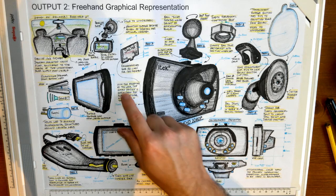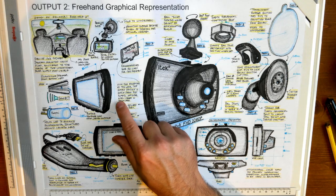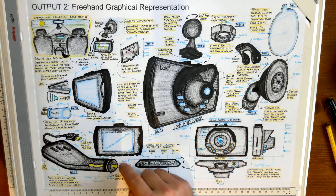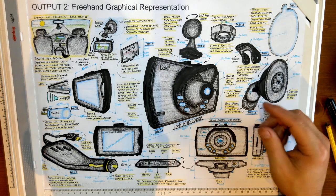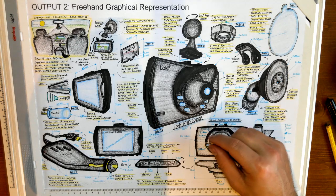I've described materials and so on. With the exception of the lens, the entire product is made from PET plastic material, 0.75 to 1.25mm in thickness. There will be certain features where it won't be plastic — for example, you'll have these brass strips which will be used for the electrical parts, conductivity and so on, to keep a stable flow of power for charging purposes, and connection purposes, for durability of the actual parts themselves.